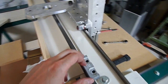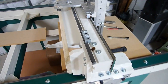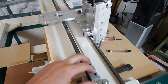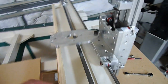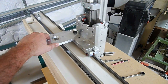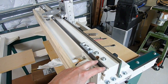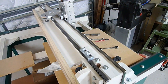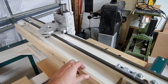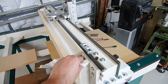These are the clamps that hold the gear track in place — this is why I cut the groove down in the gantry. They're kind of pricey and I only bought a few, so I'm going to make some wooden clamping systems that lock down similar to these. It doesn't have to be fancy, it just has to hold the gear track in place and prevent it from flexing. In the meantime, I'm leaving this track at its 48-inch length since it doesn't stick out past the steel. The side pieces I'll definitely be cutting, and maybe this one too.